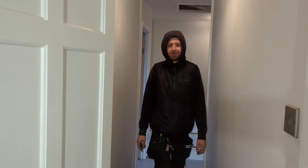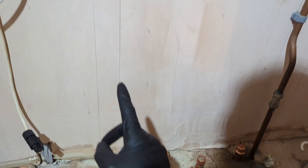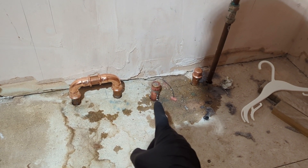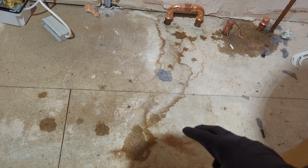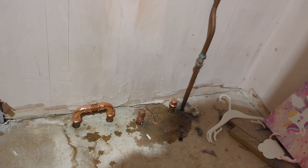Conversion's all done. That was our primary flow coming up from the boiler going to the pump and the three-port - that's been cut out. That was our heating flow - we've just linked that out and cut all the other stuff out. That was our primary return from the cylinder - cut and capped down there. That was our hot water feed - capped as well. The plan was to cap it under the floorboards, but these are tongue-and-groove chipboards and it's too difficult to get them out without making too much mess. So we've capped it as low level as possible. It's only going to be a storage space anyway, and the safe is bolted down so that's not going anywhere. Now we can start working on the boiler downstairs.